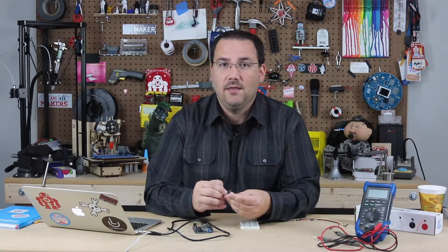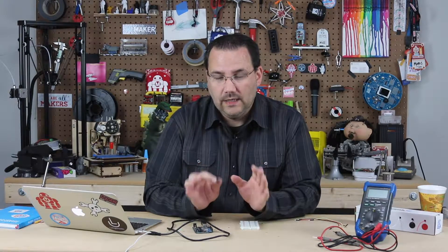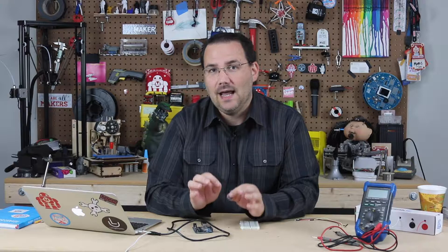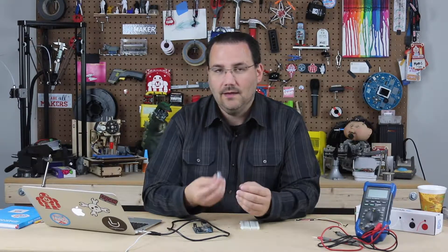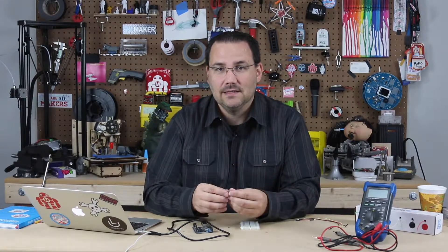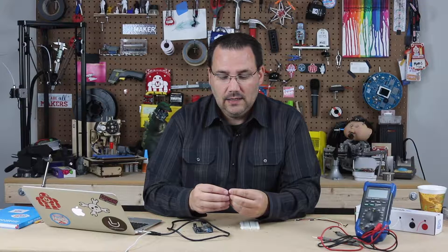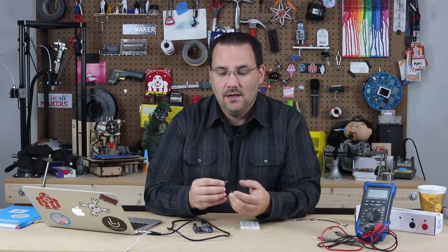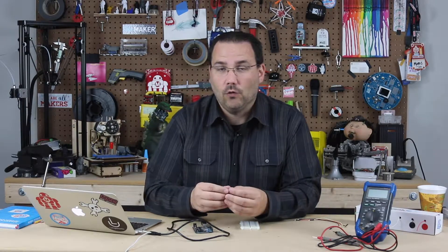The specs are on the back of the board and on the product page. What you really need to understand about measuring gases is that this sensor, just like almost all other gas sensors, does not detect what type of gas, but rather the change in gas density in a known area. That means this is not to be used for a final product — not for biomedical use, not for safety, and not in any area that relies on detection of a toxic or flammable gas mixture. This is for experimenting purposes only.